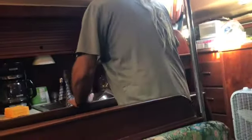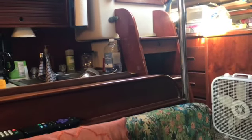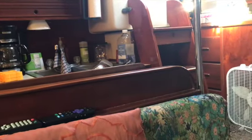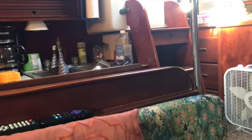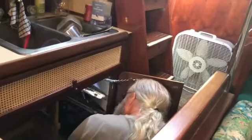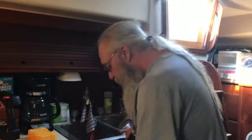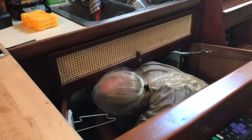Okay, you're going to turn on the water valve under the sink. Yep. And then the water pressure. Yep. And I'm going to lay down some paper towels so if there's any sort of a leak, it'll show up. Because I did some knocking around. I didn't really do much serious plumbing, just a couple of connections, but I do want to know if there's any drips. And this is a good way to tell. For me. Right, you've always done that.